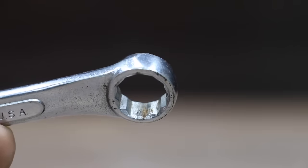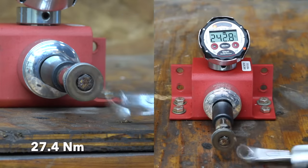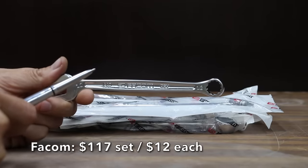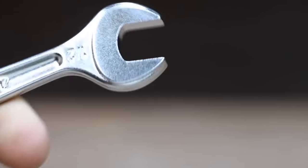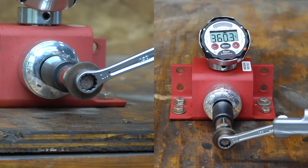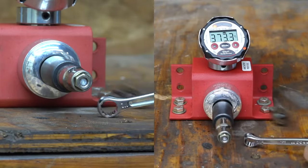I thought it'd be very interesting to also add a vintage SK Tools wrench, also made in USA, weighing 72.6 grams. The vintage SK wrench has way too much taper on the box end — 242.8 inch-pounds. At a price of $117 for 12 wrenches, or approximately $12 each, is this FACOM brand. The FACOM wrenches are designed to ensure user safety when critical tightening torque is reached — the wrench distorts gradually, meaning no breaking. Made in France, a FACOM weighs right at 69 grams, and it outlasted the bolt at 373.3 inch-pounds.